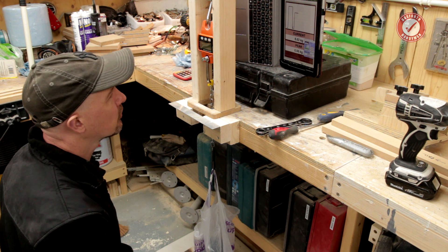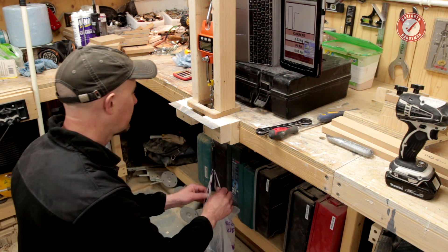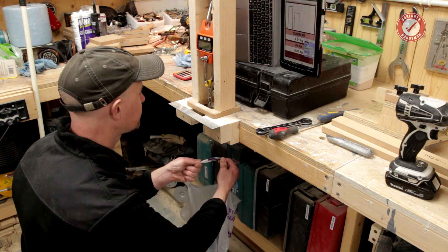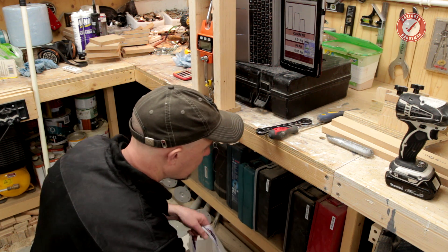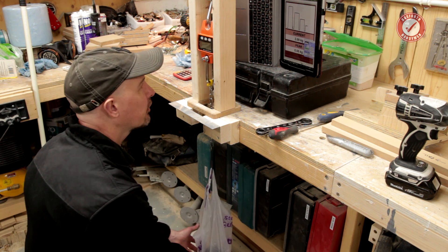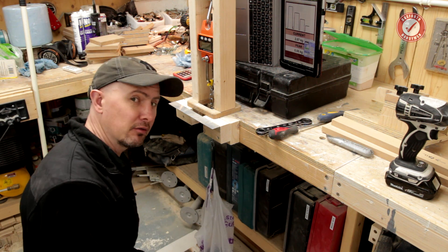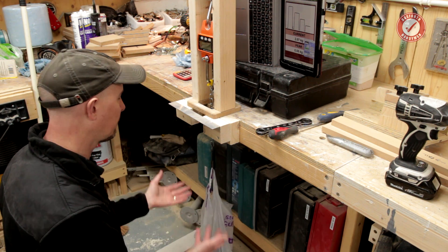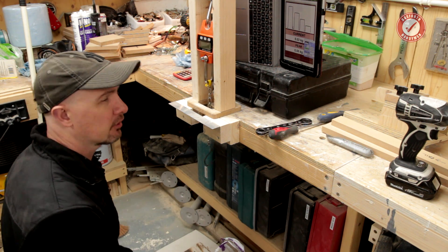As long as I'm within about 0.1 of a kilo I think that's pretty good. Four kilos — that's fine. And then two kilos: we're just within my personal tolerance at 2.08. Temperature and all sorts of things can impact this — there can be variance in a workshop and everything changes — but that's pretty decent, pretty close.